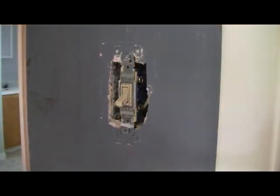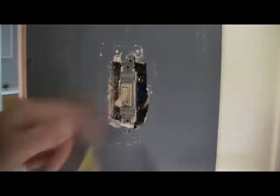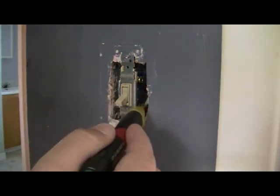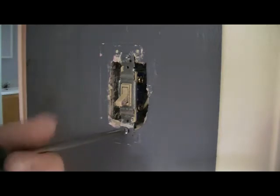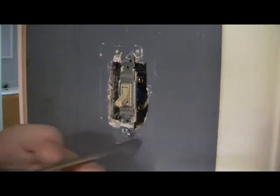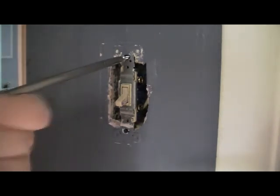We've turned off the power, let's verify. Our light is not coming on — we may have a burned-out bulb. We'll put our voltage tester in there. Power's off. Now let's take our green Robertson — if you're not familiar with the names of screwdrivers, that's the square one — as opposed to the Phillips, which people like to call the star or the cross. Phillips will also work in this case.